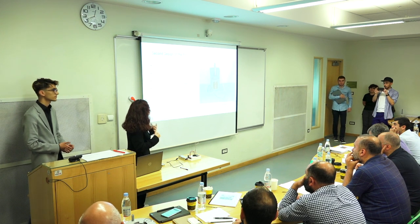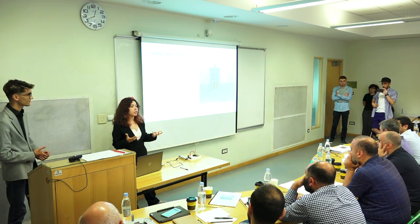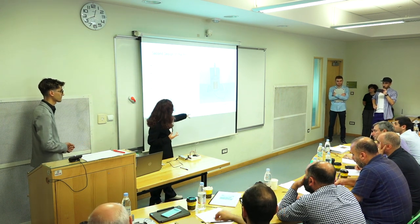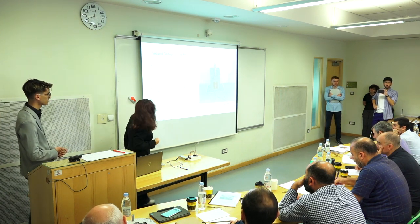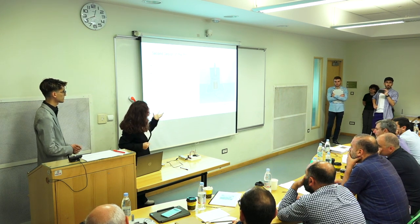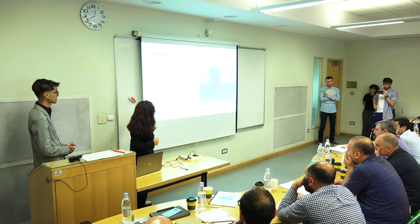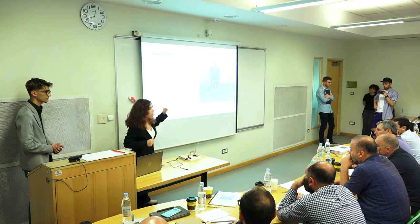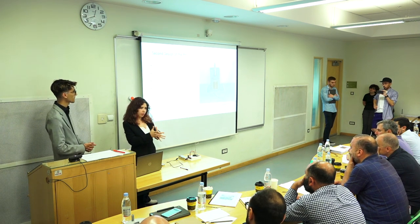And then the cover was also changed so the pin can actually stand up, to make the environment of the experiments better, so we could understand what our actual problems are, and also a place for the coil so we could position it with respect to the magnet. Still, when we supplied it some power, it was not enough to pull or push the pins. So, just for experimenting, we put a plastic piece in between the metal and the magnet to decrease the force of attachment between those two.